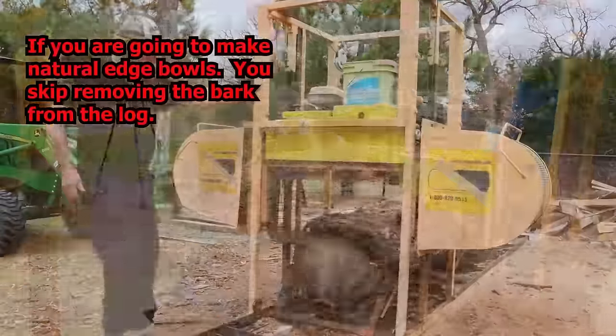But the first thing before you put it on that lathe is you take a set of calipers and push it down and measure it and make sure that you've got that much depth in it, or you've got to use a spacer. So always check that, because it's dangerous to screw this in only halfway. Say it hits bottom. So check that as you put this on your lathe.